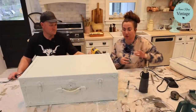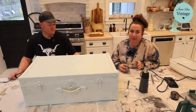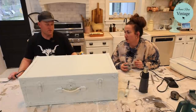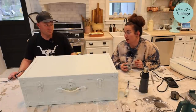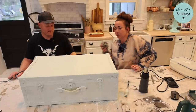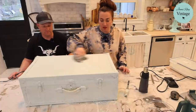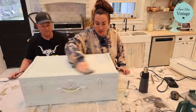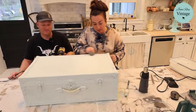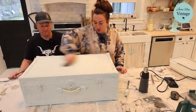If it's super chippy and you put a transfer on it, the transfer may chip off too. Make sure there's no extra dust from distressing, seal it, let it dry, then put a transfer on — you can put a transfer straight on milk paint, just make sure it's dry and dust-free. We're going to try the new IOD Desperado transfer — the one with the skull and flowers. I've been wanting to try that for a while, this is a good piece for it.